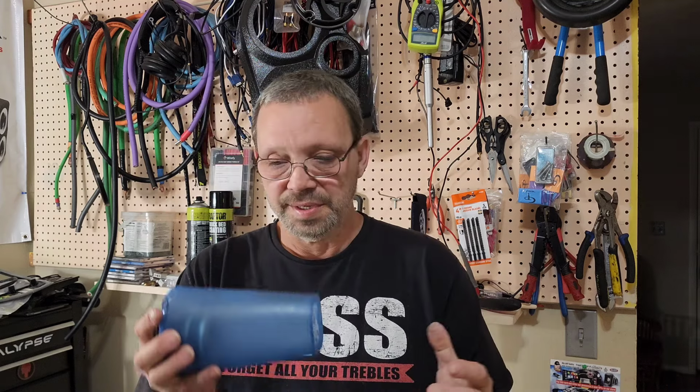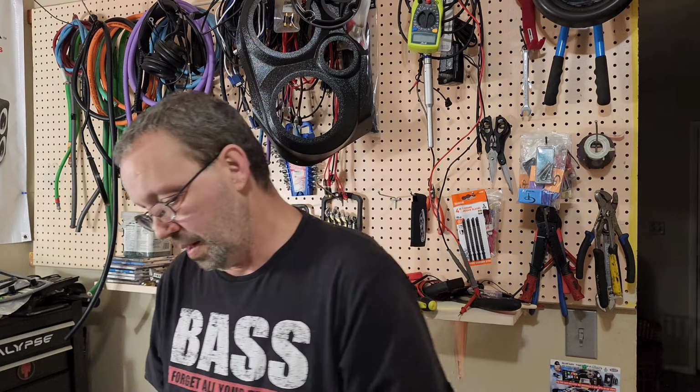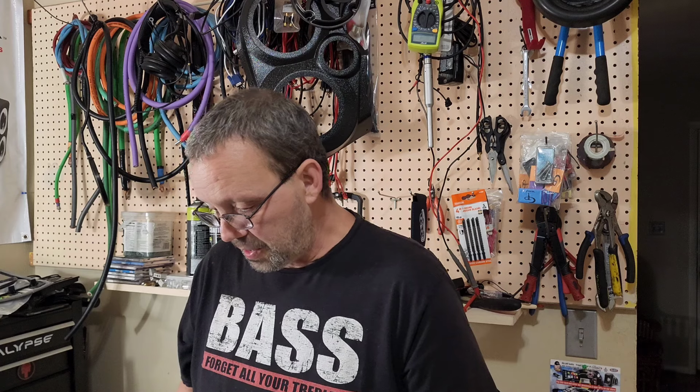It builds up pressure inside the container. So as that sucker is moving, it's going to be trying to expand that container. For a subwoofer or a speaker that's designed to operate in an enclosure, it's designed to operate in an enclosure of a specific size. The reason for that is the amount of air inside that enclosure is the right amount of acoustic spring for that sub or speaker to bounce off of and to operate within its parameters.